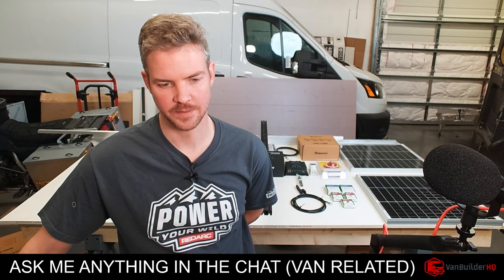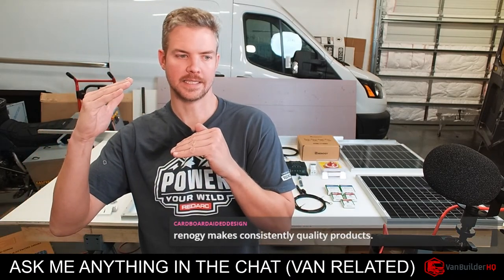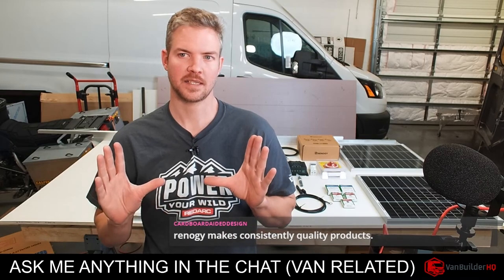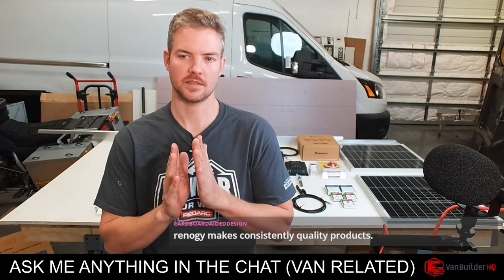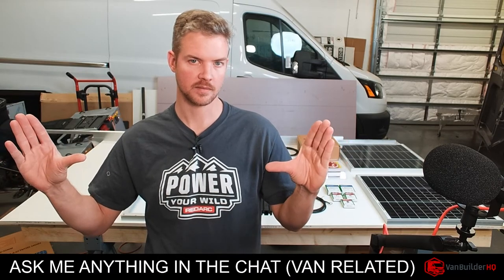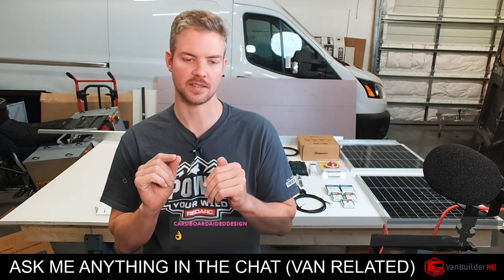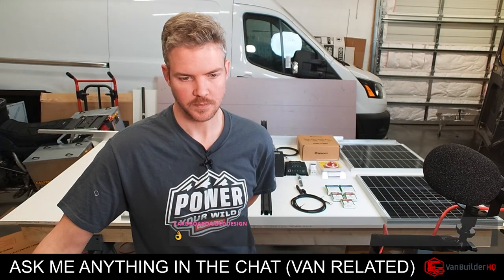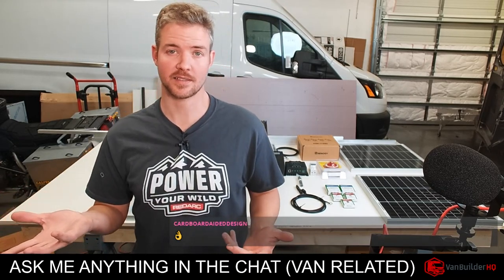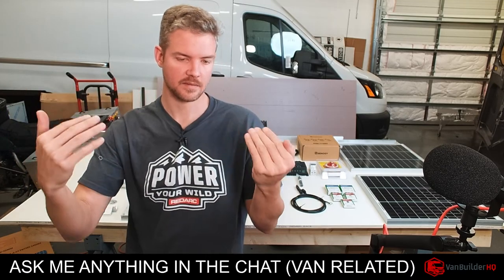So that's something that we'll have to deal with, it just kind of comes with the territory. When the Maxx Fans are up, it's going to put a little bit of shadow on it. But when you think of solar, you've got to think long spans of time, 4, 5, 6 hours of the day worth of power range. Your immediate power is not what you're really looking for in solar. But depending on the solar panels, yep, slight angle, definitely. You guys will probably notice this over winter time. The sun's at a lower angle in the sky, and the panels are less effective.